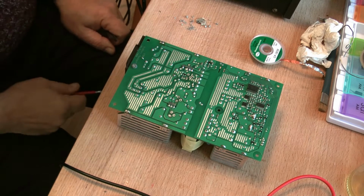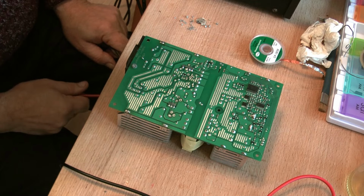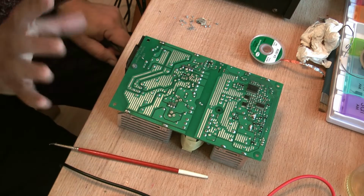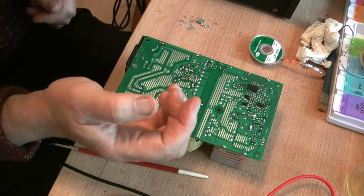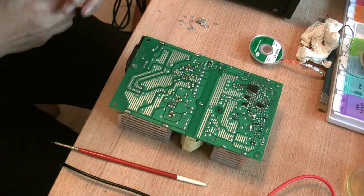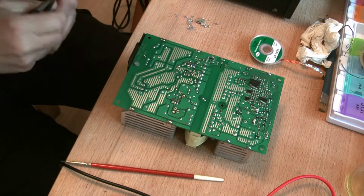And although a solder sucker works extremely well, it does get blocked quite easily, and so the time it saves you over some other techniques is offset against the time you spend unblocking it, and horses for courses. But I prefer it much to the pump thing that you just go plop with. They're useless. I haven't got one in my toolbox.